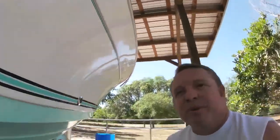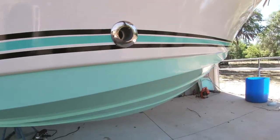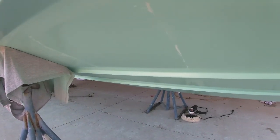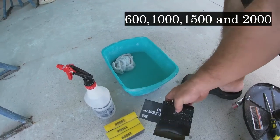Now that we've got the boat painted, we got to come back and do a couple extra things. I missed this step showing you guys how to do this. The majority of the boat that you're going to see has already been wet sanded and gone through all the steps to bring out the shine. Now, where I can show you is right here where these pads went — I still have a dull finish. So what I'm going to do now is show you, once you get done with that initial two coats of paint, we got to go back and do some wet sanding. You're going to need a few things for this — I'll show you my tool list. You need a bucket of water, a clean rag. That clean water is very important.